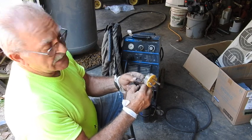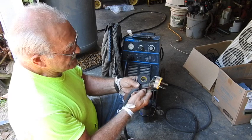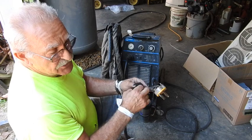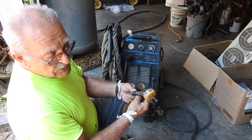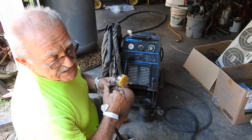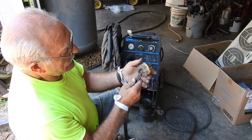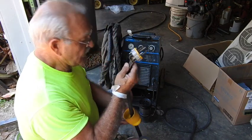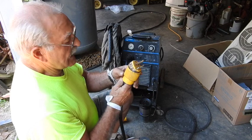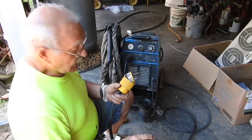The third wire is what you use for three-phase. And remember, when it was connected for three-phase — and because it's auto-ranging — when wired in that configuration, you can apply any three-phase voltage: 208, 230, 460, all the way up to 575 volts, 50 or 60 cycle, three-phase. Now I'll go ahead and plug this in once I put the cap back on, tighten this up, then plug it into my power supply. We'll turn it on and see if we make sparks fly in a good way.